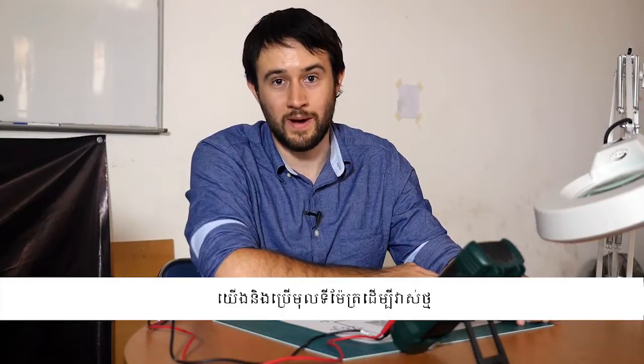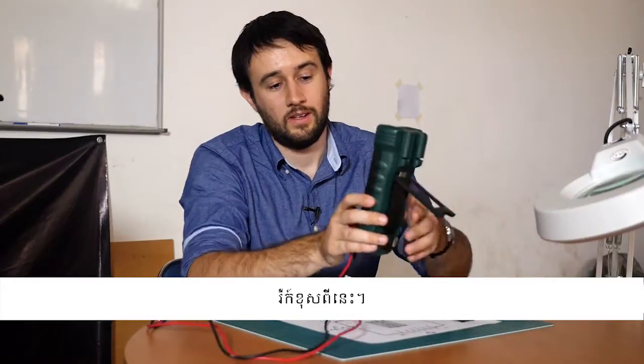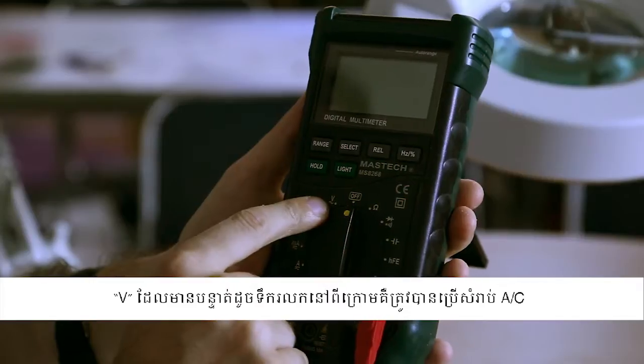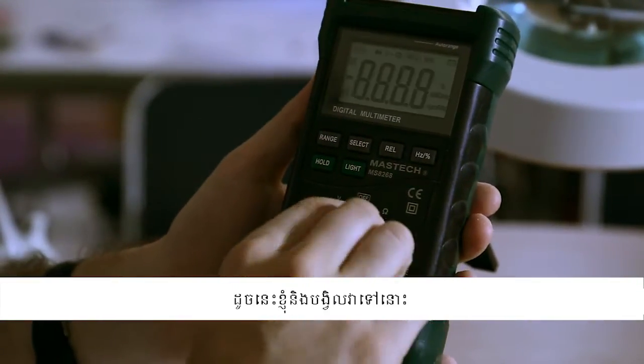The first one is the simplest. Let's use the multimeter to investigate the battery and work out whether it's really 9 volts as we expected, or possibly something different. Going to the big dial, we're going to turn to V with a straight line underneath it. V with a wavy line is used for AC — alternating current. In this case we're using direct current, so we turn to that.